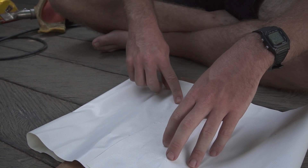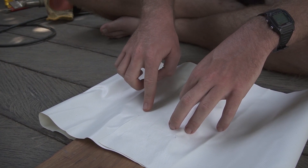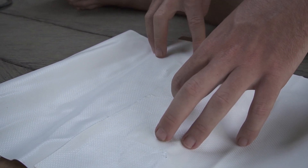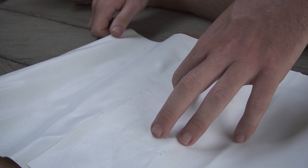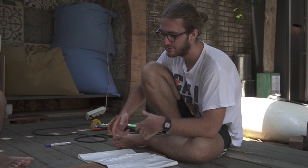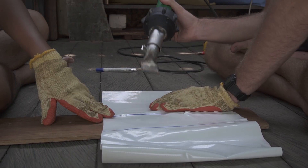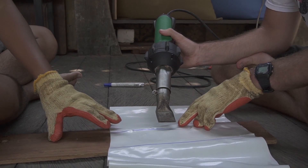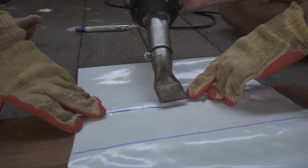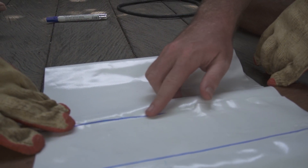As long as you can still feel resistance or move the material, that's not acceptable. Check the whole length — wherever you still get resistance, go over it again with the heat gun. Once the inside of the bag is completed and all the edges are welded, turn the bag from the inside to the outside again to the side with the lines and repeat the same welding process. Weld the edges again: do not touch the material with the heat gun, wait until it slowly starts to melt, then go over it. From both sides it should feel pretty soft — that's how it's supposed to look in the end.